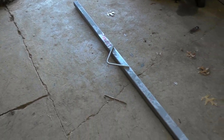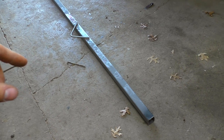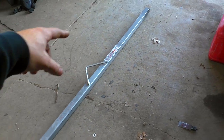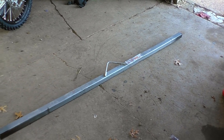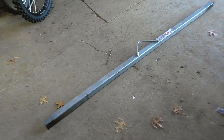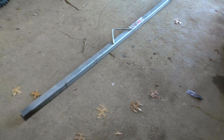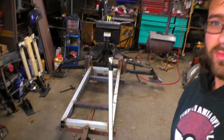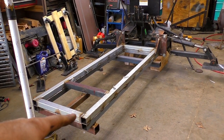What you're seeing here is 2x2x1/8" wall steel tubing. The reason I plan on using this is we have an abundance of these at work from doing lift gate installs. These come factory from the lift gate — they used to be welded to the lift gate uprights but now they're bolted. It's just a tube used to lift and install the lift gate. We have several of these sitting on the shelf at work for free. I'm gonna double-stack and stitch-weld them together so you end up with 4x2 square tubing. I got a little carried away and before I could pull out the camera I went ahead and built the framework — they're 5 feet 6 inches long.